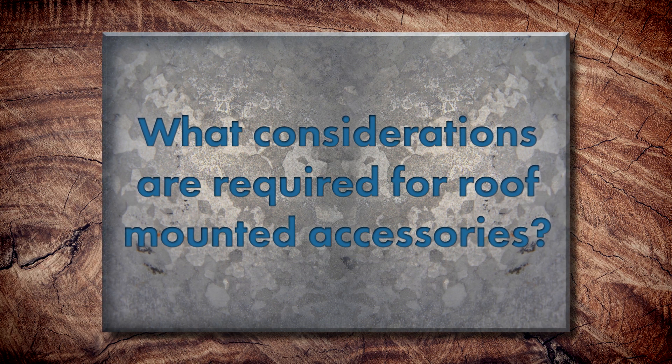What about other types of accessories added onto the roof later, like satellite dishes or snow guards? With satellite dishes, you always have to worry because the person putting up a satellite dish isn't a roofer — it's a cable guy. More than likely, he's just going to screw it down to the roof and maybe put some caulk on it. There are other ways they can be installed that aren't going to be as invasive, because otherwise it's going to start voiding warranties. You might not have a problem immediately, but possibly down the road you're going to run into some problems — that's pretty much true with any type of roof-mounted equipment or accessories installed after the fact, especially by someone who wasn't your original installer.